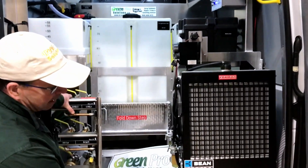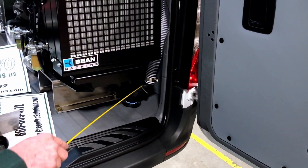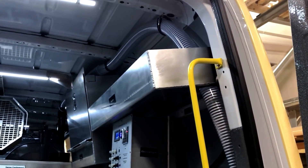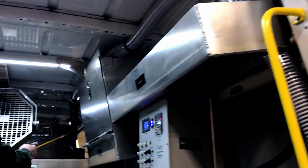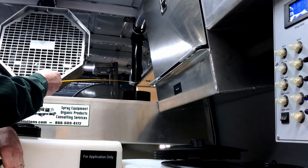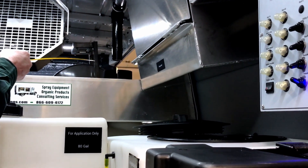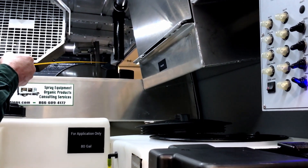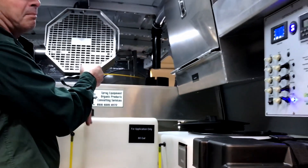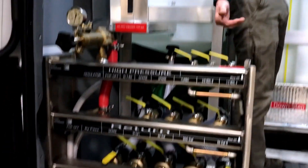Now this has an outside two inch cam coupler, which comes from the outside, goes underneath, up through this two inch tiger hose, and goes into a downspout and into this cone. Some states require that there's a four inch gap here to separate from the tank to here. What's different about this fill system in comparison to the brass one is this is the only place it gets filled into this 300. Now the pump will take it from the bottom of the tank, which is the bottom of the manifold suction, and pulls from there.